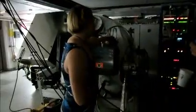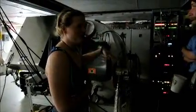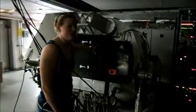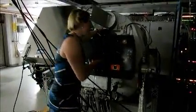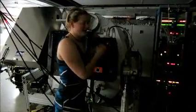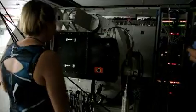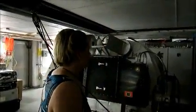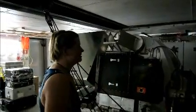The light we're detecting is one to three millimeters, and that frequency of light just passes right through that window — that's the focus of our telescope. Inside this giant white box, we have a secondary mirror that brings it to the secondary focus. And this is the receiver cryostat I showed you — this outer shell is at 300 Kelvin, and this is the pulse tube bringing down the inner radiation shield to 4 Kelvin.